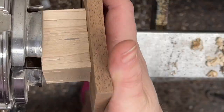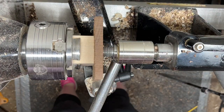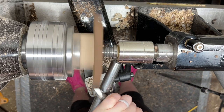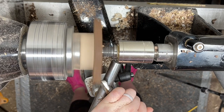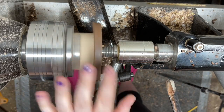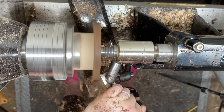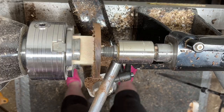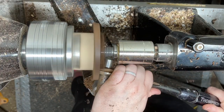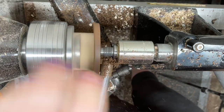I'm switching back to the original chuck — this one is a Nova. Now that the glue for the waste block is hopefully fully cured, I'm getting ready to turn the tail. The tail is really essentially just a disc, but I like to put a little bit of a bowl shape into it, so it's slightly convex on one side and slightly concave on the other. I like to make the concave section face forward so that the tail sort of wraps around the turkey body a little bit. I'm using my Thompson bowl gouge to scoop out that concave section — that very shallow bowl.